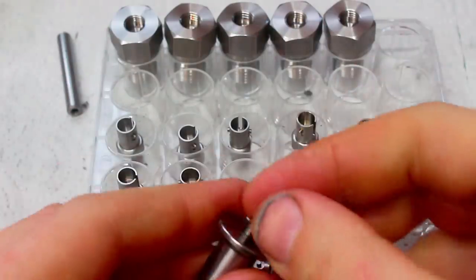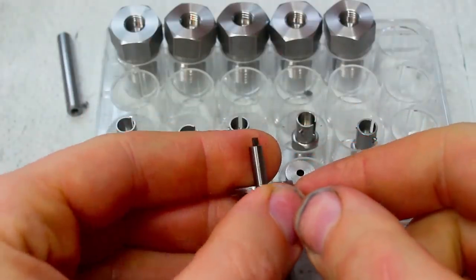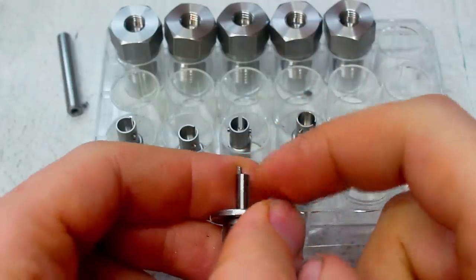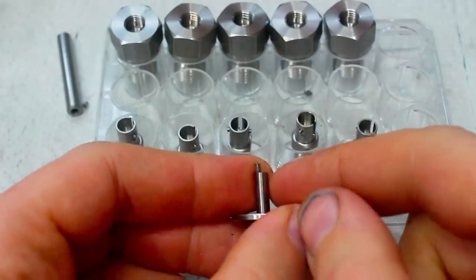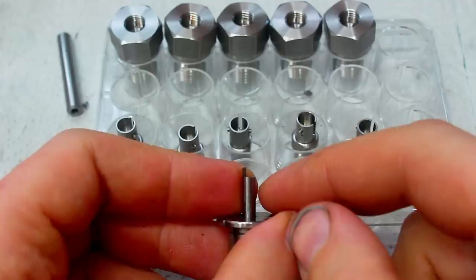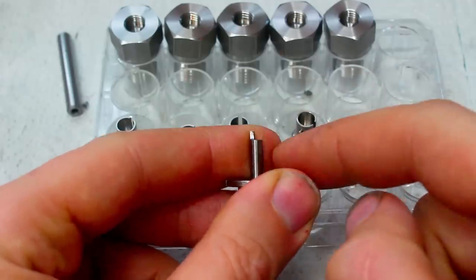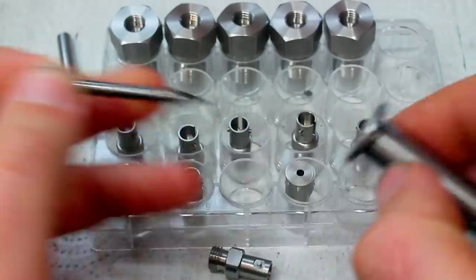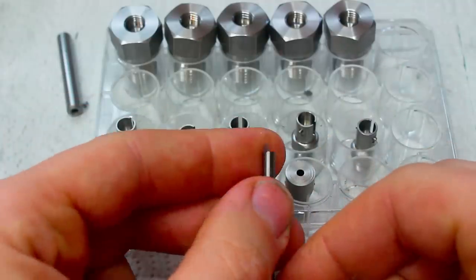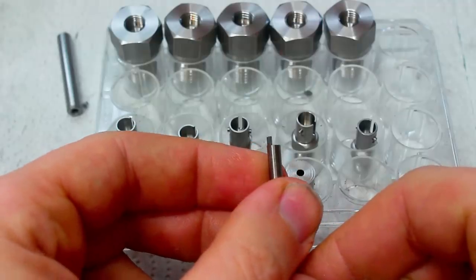And I went back to the drawing board, and then I had the idea of making a trepanning tool. First, I looked if a small commercial trepanning tool was available, and there is none. Nobody trepans, apart from watchmakers, features that small. So I went over to the tool and cutter grinder, and I created this tool here. This has a 4 millimeter carbide shank, it's an old end mill, and this is basically a trepanning tool.